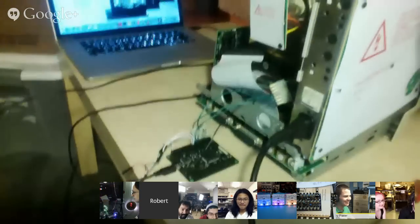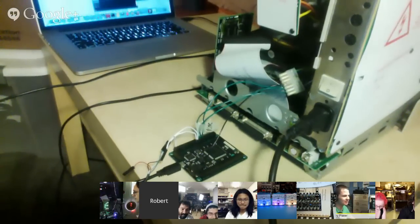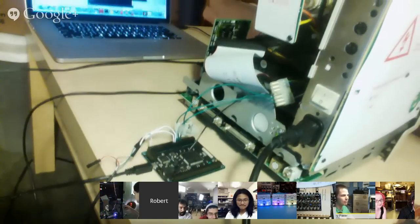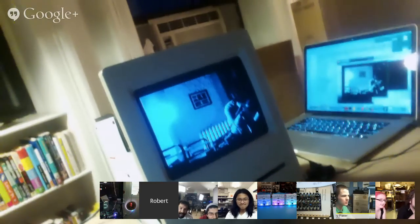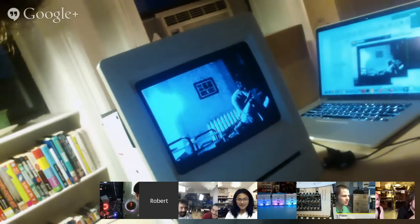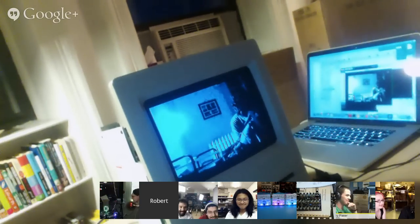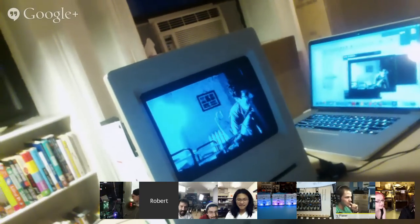Yeah, essentially I got this Mojo FPGA, and it's getting serial data from that computer, and just clocking out the vertical sync, horizontal sync, and the data to get this screen showing what that screen's trying to show. Wow, okay. This is the first show and tell on that. It's a Mac Classic. What's the processor that was on this thing? It's like a 68040, I think.